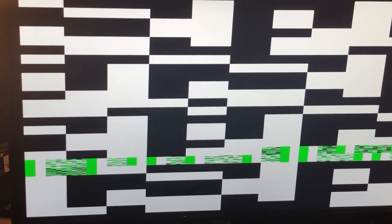Let's get started. As you can see, these blocks on the screen are normal — they're used to test the read and write from the memory chips. However, what's not normal here is the green glitches you can see. That kind of confirms it is a problem with the memory chip. Let's wait for the test to finish and then the software will give us a report on which exact memory chip is causing the issue.